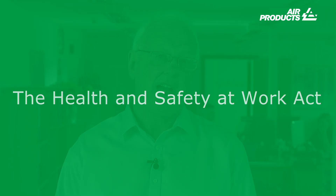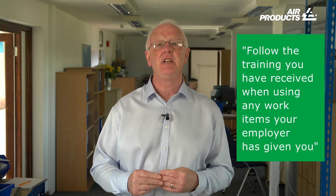The legal implications: as the end user you can decide whether or not to follow the standard and guidance document. But if you don't follow the manufacturer's instructions and there is a subsequent incident, you would almost certainly have to explain why you didn't follow best practice by adhering to the manufacturer's guidance. The Health and Safety at Work Act tells us what we must do, and this reinforces bump testing as a legal requirement. While your employer is responsible for health and safety, you must also follow the training you've received when using work items your employer has given you. If training highlights the need for bump testing in accordance with the IEC standard and manufacturer's instructions, taking the decision not to follow that training would mean not following a key health and safety at work requirement.